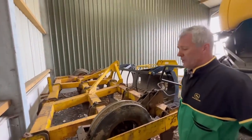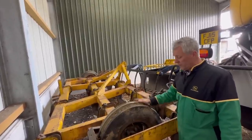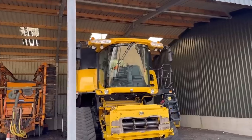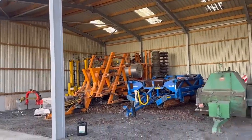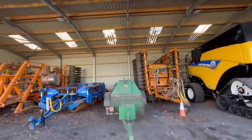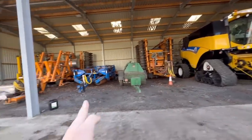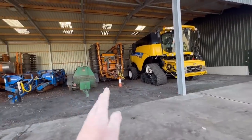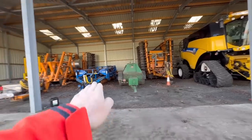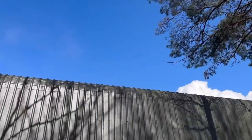They only use the superflow drag once every two or three years, but the job it does is brilliant as you can see from that field. The machinery shed has really wide bays - Andrew's put in dummy carrier beams so instead of having girders every four to six metres he now has eight-metre openings, so you can get loads of machinery in and get it all past each other. At the back the shed doesn't have a gutter because trees would block it, so it's got a curved eave and a French drain along the bottom - a great idea.